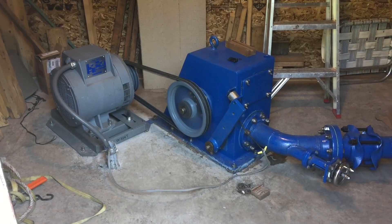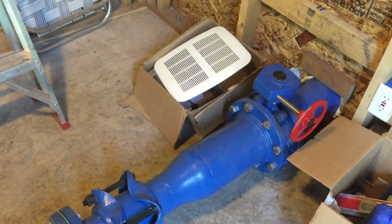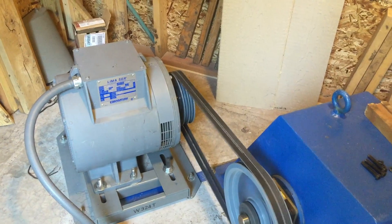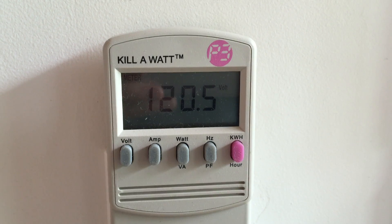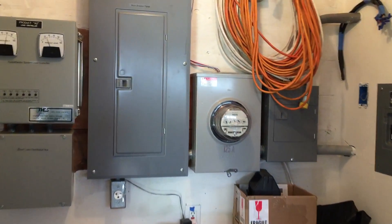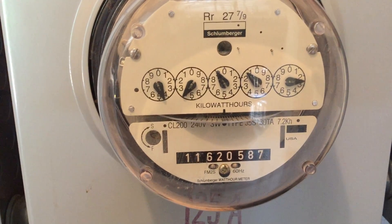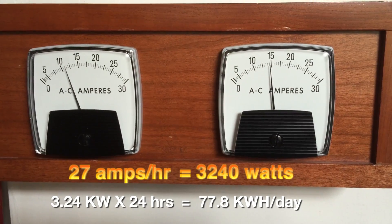Just the beginning. More water from the creek will be added to the meadow and more useful load installed as we make numerous improvements to the system, but for now everything is running fine. There's a quiet hum from the transformer, but it's mostly absorbed by the wall. We have adjusted the voltage regulator in the generator to compensate for any resistive line loss to ensure we get 120 volts in the house. Our power meter is spinning away nicely, and we initially have 27 amps of carbon-free continuous alternating current, but we will be increasing the output as we make improvements and add in water.